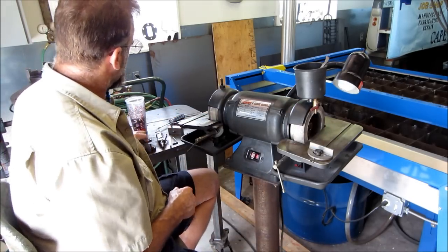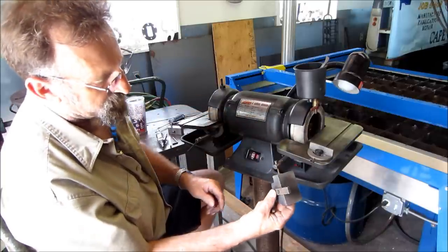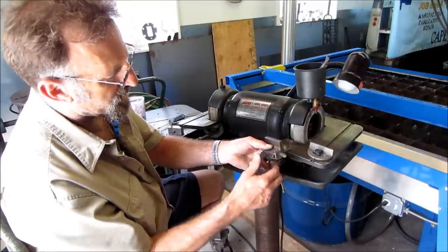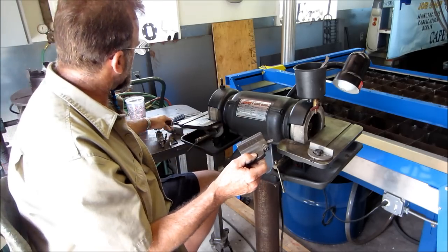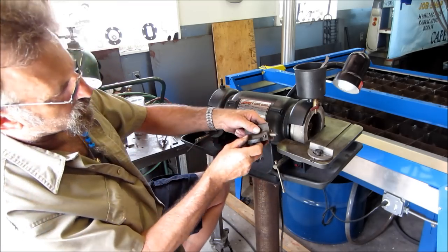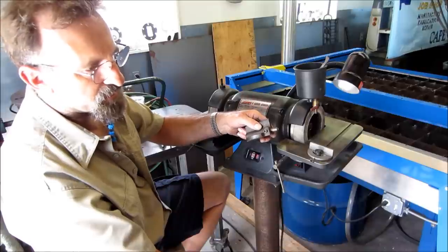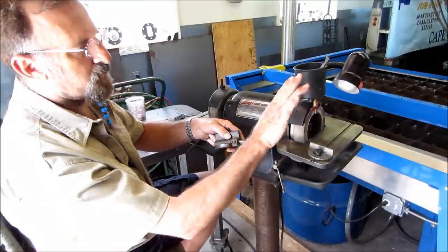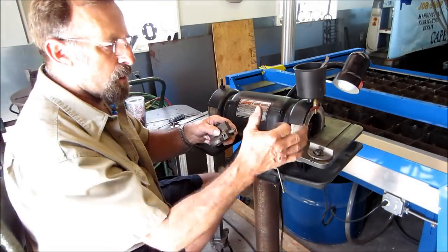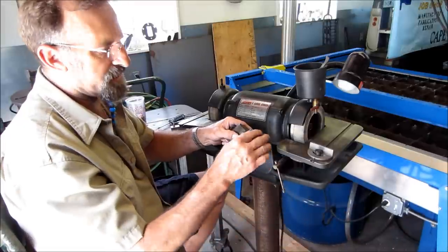Now what I had, this was a protractor slide, and this was made for another grinder, and it has a stone receiving bore there. And also, if you notice on any of these, there's a slight little angle, all right, and you want a way direction when you're grinding on a stone there. You'll see none of these ever point into the stone on the grinding, so you always want to grind away. If that diamond comes loose, you don't want it to roll into the stone, okay? You want it to flake and blow away and not damage your stone.